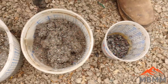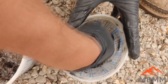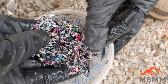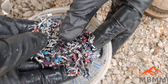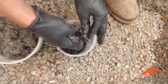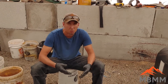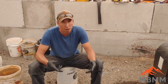This is the number four tailings. Every once in a while there's a little piece of wire in there that still has copper in it, but almost all of this is liberated insulation where the copper's been pulled out and you just have the insulation left over. We ran about 60 pounds of ribbon wire. It took us about half an hour, and we were playing around, so you can probably run faster than that.